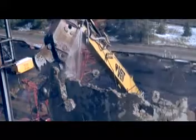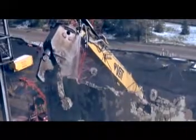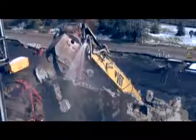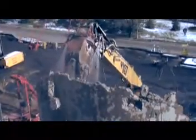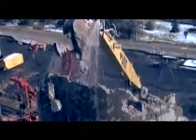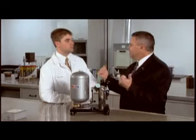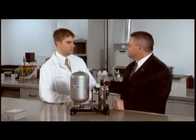Pound-out is really when a big piece of equipment slams repetitively either into earth or rock, or just slams the bucket repetitively back and forth. When you see that bucket coming up and down on a front-end loader, say? That's exactly right. When that occurs, all of that pressure from that heavy load is pushed directly onto the pins that hold that bucket to the piece of equipment. That whole load forces inferior greases out that cannot cling to themselves or to metal components. So once that pound out occurs, there's nothing there to lubricate those pieces of equipment.